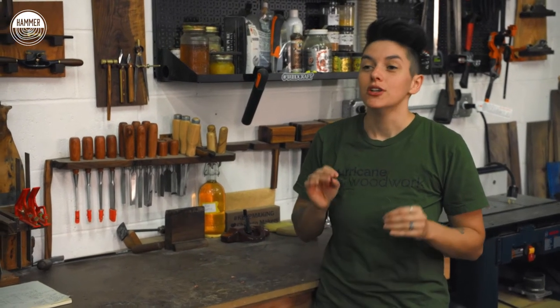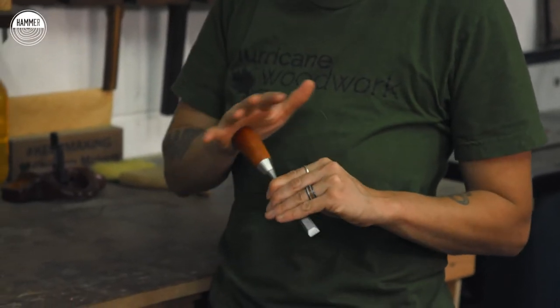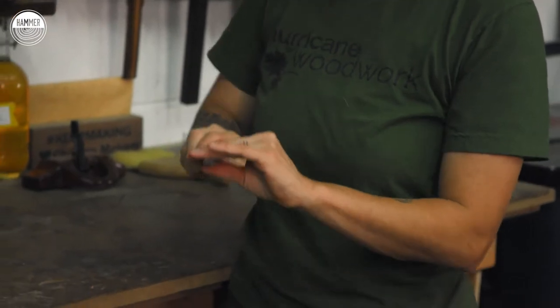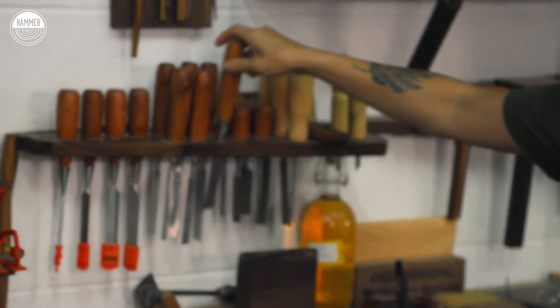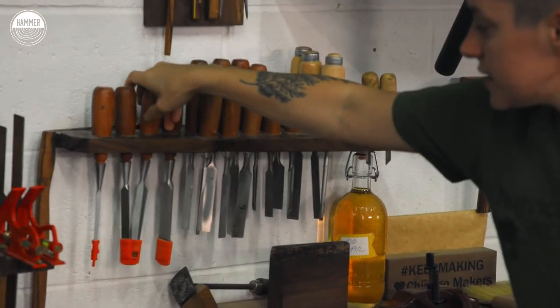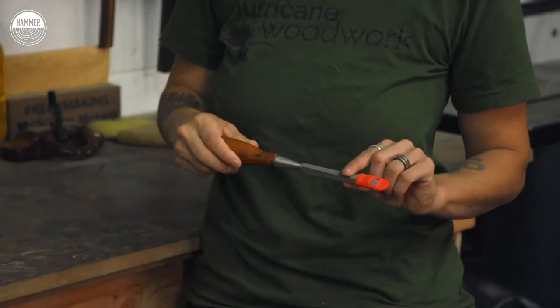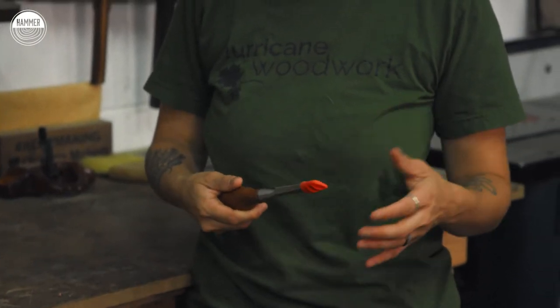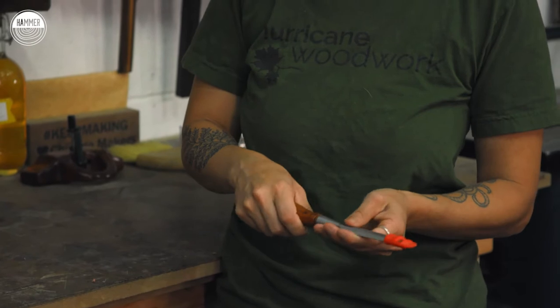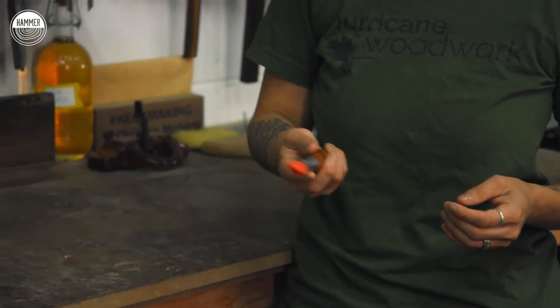Chisels are my jam. You have an abundant amount of options on what kind of chisel you can use, and there are different chisels for different applications. The butt chisel is for shorter applications — it's a lot shorter in length, the handle's a little shorter, and it gives you more up and down control versus angled. Your bench chisels do the angling and give you a nice long blade to work with. Your dovetail chisels have a strong taper to prevent you from damaging the joinery work, because you want those to be nice and clean and fit together. It also has a comfortable long thin handle that allows you to angle it more, get a little bit deeper, and has a little finger hole.